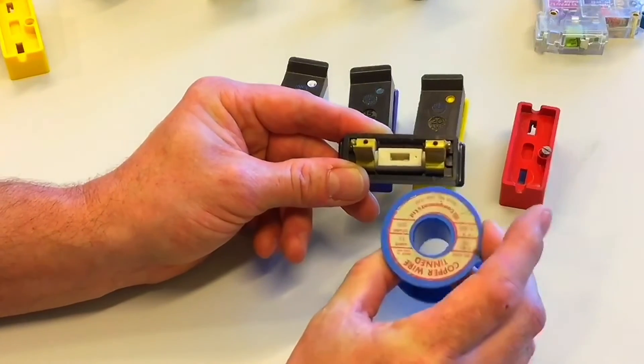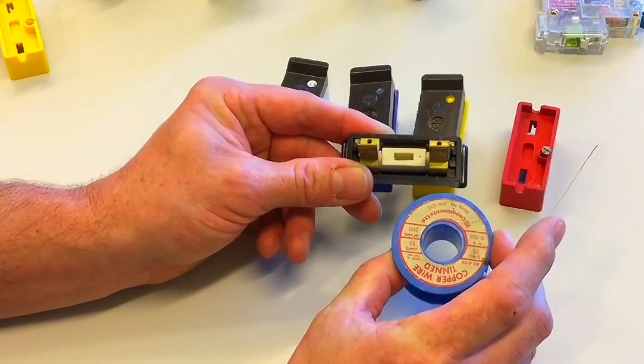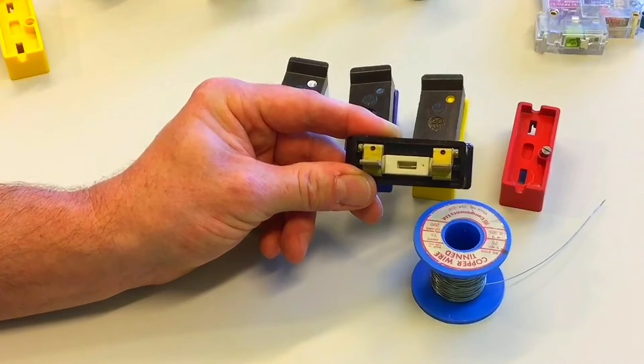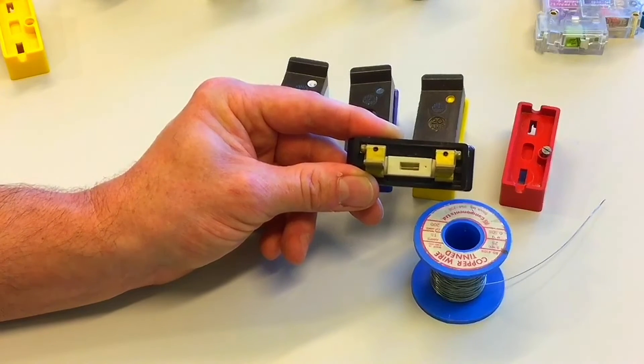However, even on the fuse wire element itself, you cannot find the S1A rating. So you always have to presume the lowest rated — in other words, 1,000-amps. These devices can only clear faults up to 1,000-amps. When testing for PFC, you need to confirm that the prospective short circuit current won't exceed 1,000-amps, as these devices will fail in that part of the installation.